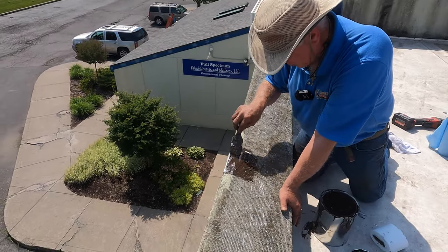Do the transition halfway over the wall and over the edge, then paint the rest with Turbo Poly Seal all the way to the bottom. You may want to use a fleece here as well, but in this case it looks good. The best way to preserve this parapet wall is to paint it all the way to the bottom. If you don't, you'll have to restucco it. Then coat this roof with silver paint — that will keep the Turbo Poly Seal from breaking down in the ultraviolet. Otherwise you're in for a new stucco job.